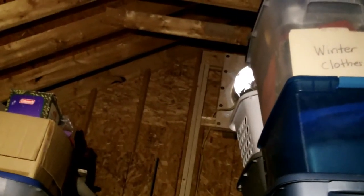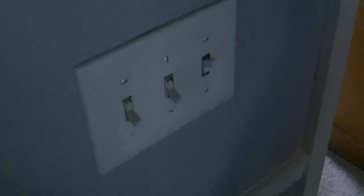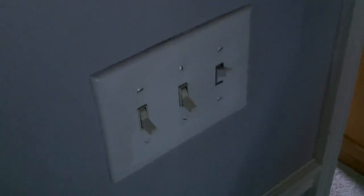With that three-way switch, I'll show you how that works. Right now the three-way switch works such that the thermostat is being controlled when it's in the down position. Now we're down at the switch - it's in the down position so it's thermostat controlled. If I flip it up, you can hear that - fan turned on, that's the bypass. So it's either thermostat controlled or the bypass, and everyone's happy. That's the installation of the attic fan. I don't think there's too much else to do except cleanup. Thanks for watching.